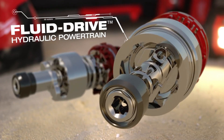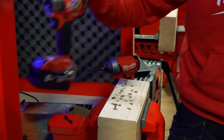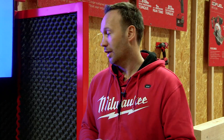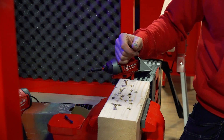Does that give you as much impact as the old metal on metal? The impact duration is longer than a standard impact driver, which means on the 6x100 you don't see any difference in performance but you see a big difference in sound level. So the days of noisy impact drivers are numbered? Yes, especially for general applications where customers use up to 6x120-180mm, it's a perfect tool. Of course if you need more power you still have the standard impact driver for bigger applications.